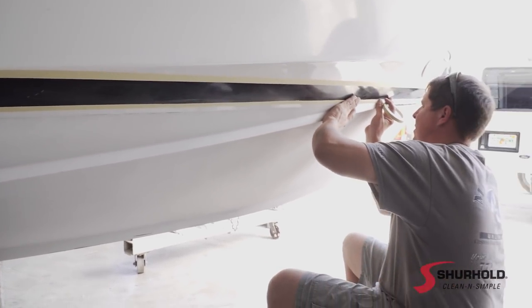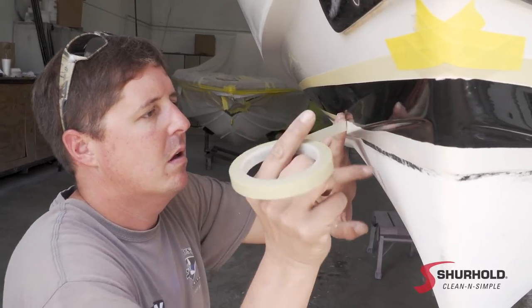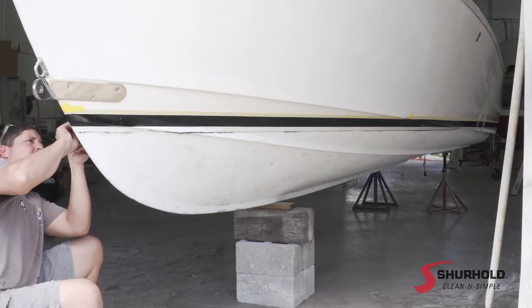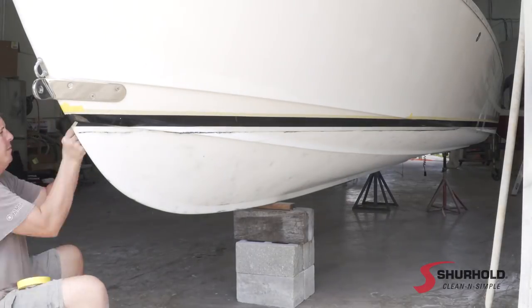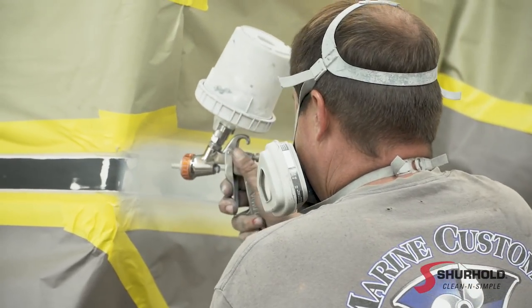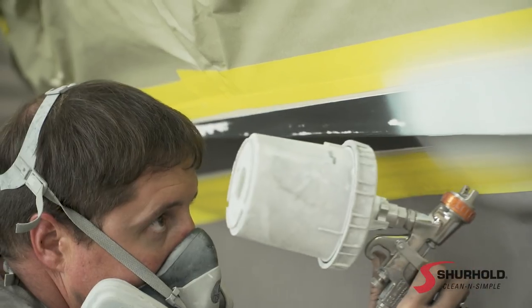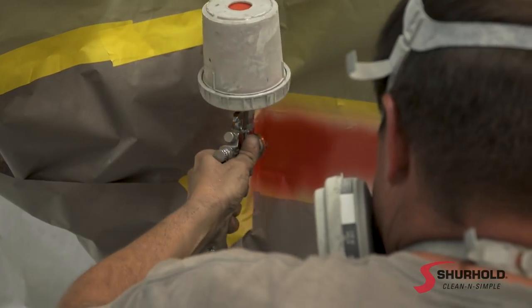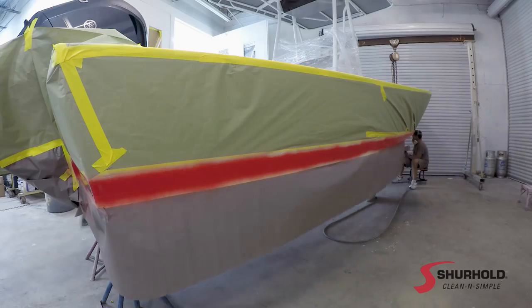Back at it again working on a 23-foot Albury Brothers boat. First thing we're going to do is add a bootstripe to it. The biggest thing to remember is when you're taping off, you use fine lines. It's a little more expensive, but the end result gives you that nice crisp, clean line. This is a great way to customize your boat — multiple ways of doing it. You can spray it, you can have it rolled on, or you can get a vinyl decal. My personal opinion, spraying it on is going to be the best way — best result and longest lasting.